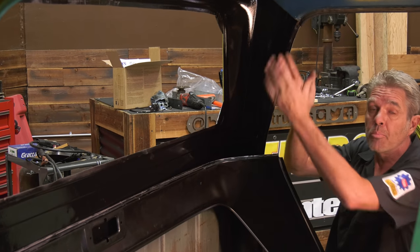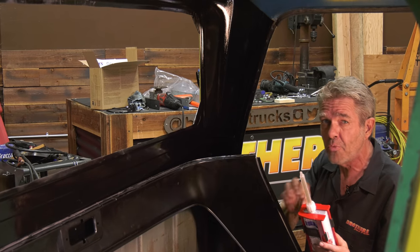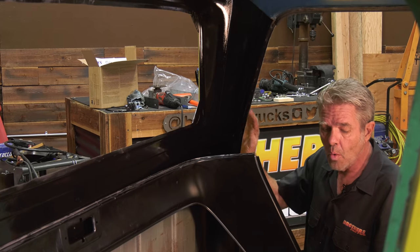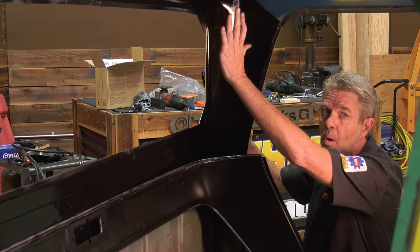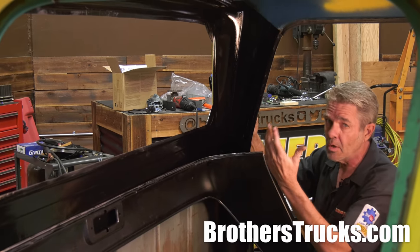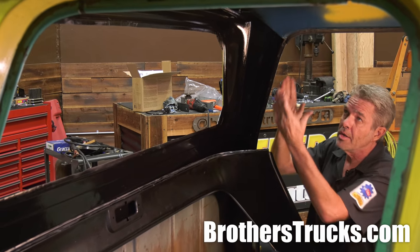And then we're gonna put it up. Now you can only manipulate this before it dries hard, for about an hour and a half, and then it's done for. So what we've got to do is put this on, and we have to be sure that when we go up in here, we've figured out how we're going to clamp things and get it all set up, because once it's glued, it's going to be a real mess. So I'm going to go ahead and get this on, then I'll get it up in there.